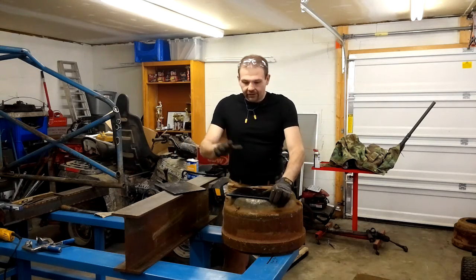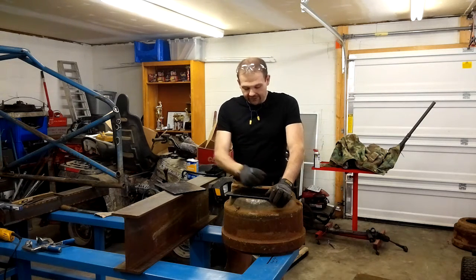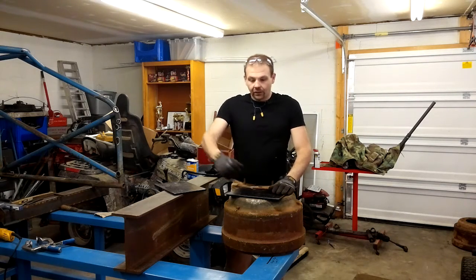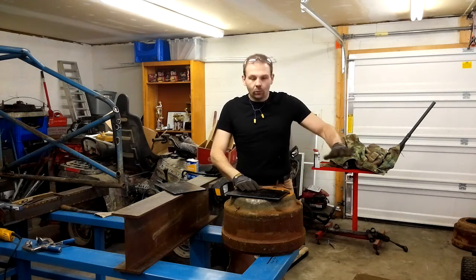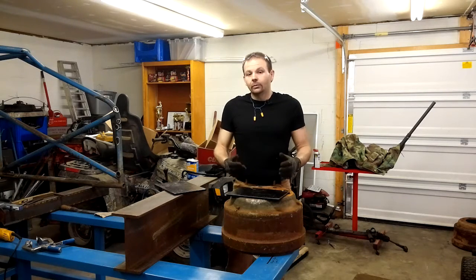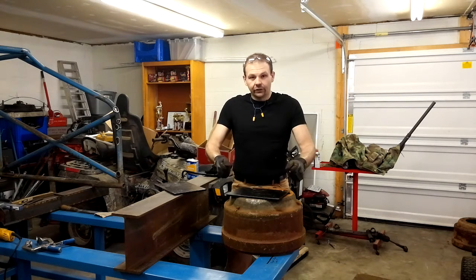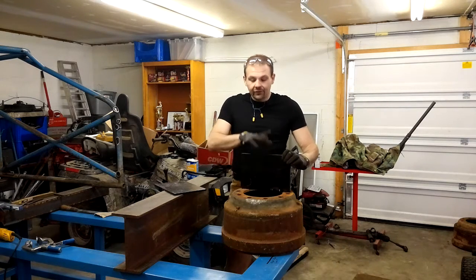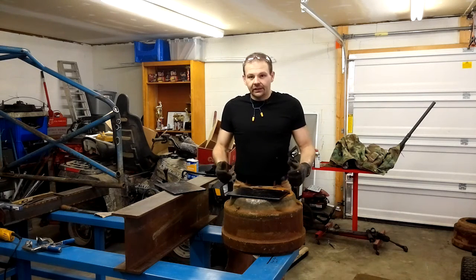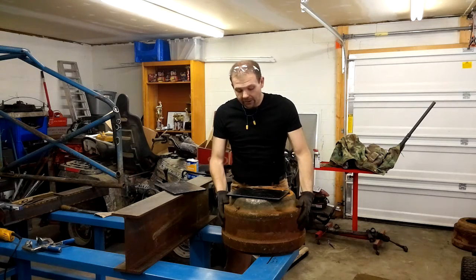Gonna take some 2-inch square tubing and weld that to one of these plates. I've got a couple of these plates, and weld that to make a stand, you know, about the right height. And then I have another piece of square tubing that will slip over top of that to make kind of an interchangeable joint with even more of this plate on top of that. Then what that will give me is a very universal stand. I'll have the big heavy part.